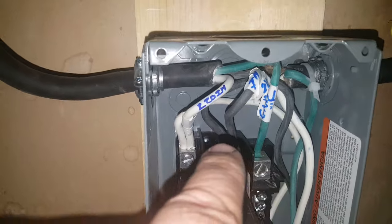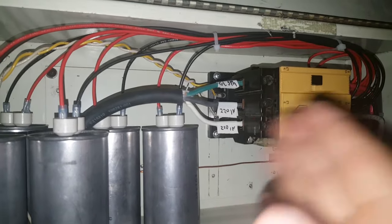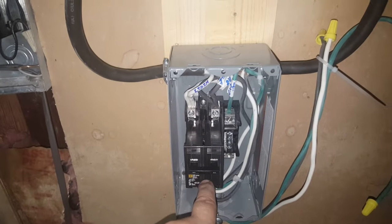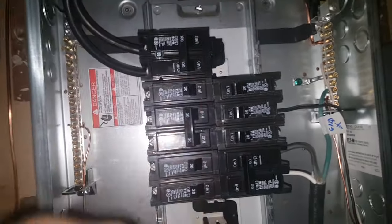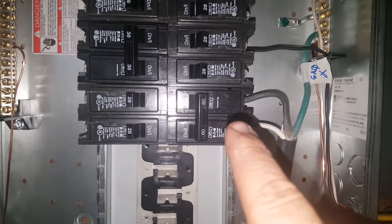You can see two sets of wires paralleled up — that becomes phase one and phase two, and the third one generated by the motor is phase three. All these breakers isolate each circuit. This breaker is a safety for the coil so that if it shorts out I can kill it. The 220 has a breaker between it and the main panel. The main 120-amp breaker protects these wires. The 60-amp breaker protects the whole system. The switch runs on its own 120-volt circuit in series with the coil.